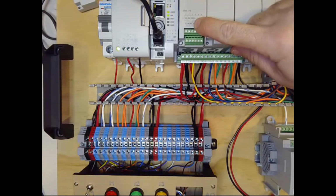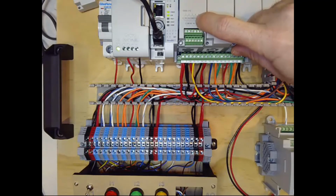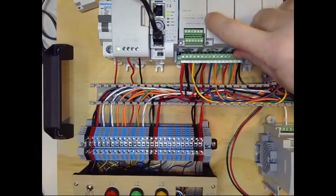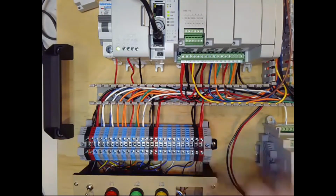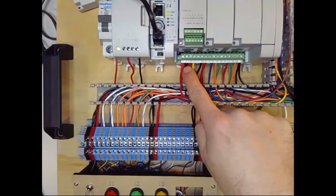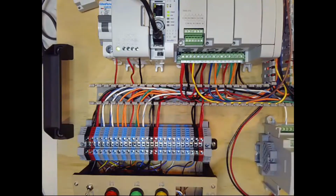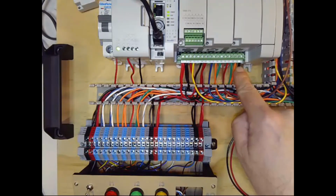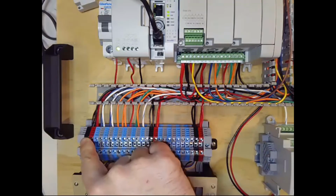And then if you look on your block, you can see there that input 1, the second input, if we're using a voltage, is going to be on terminal 4. So we're going from terminal 4 to this gray block and from terminal 6 to a black block. In this case, any of the black blocks, or anywhere we have a black wire here that's referenced to our 0 volts, will work. I haven't decided yet which one I'll land it on, but just pointing out that electrically these are all the same potential. It should be 0 volts.